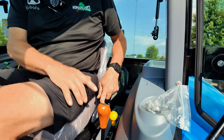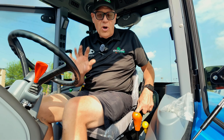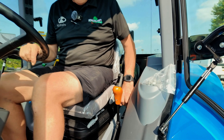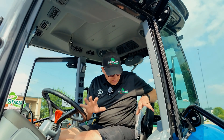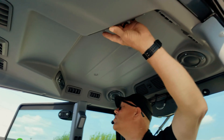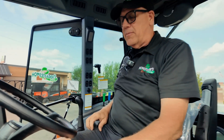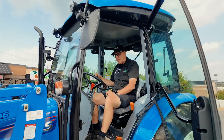You have four ranges of four gears, so this is a 16-speed tractor. You also have, with all LS tractors, the option to have a forward PTO shaft — that's what this yellow knob is back here. It doesn't do anything right now because that option isn't installed, but that is where you would add it. The ergonomic design is excellent. Looking up above, you have a radio included, heater controls, and many of your lights and wipers all controlled here. Just an excellent arrangement that you can see all at your disposal to quickly adjust.